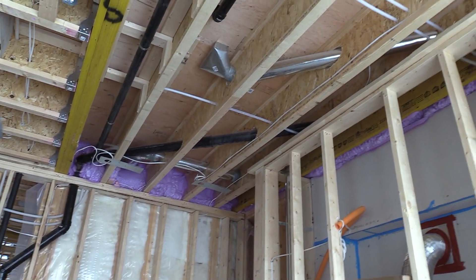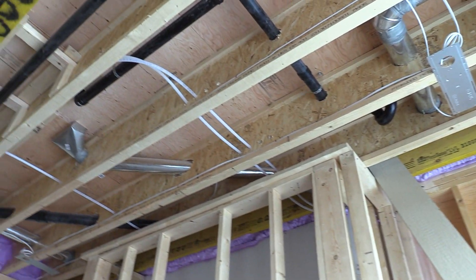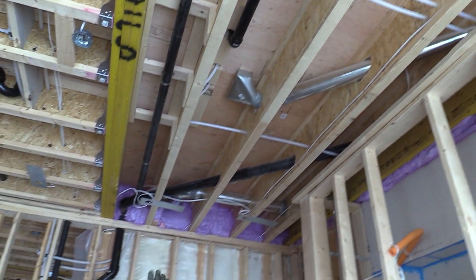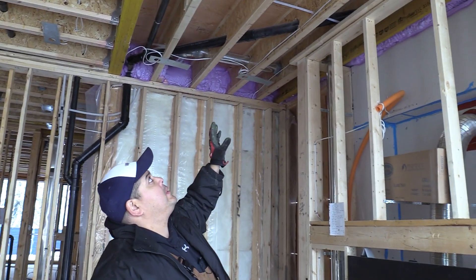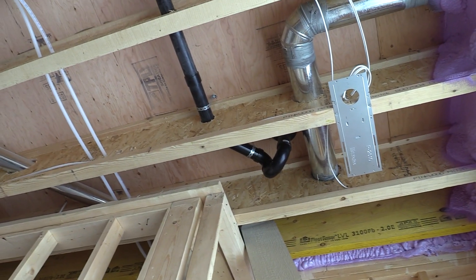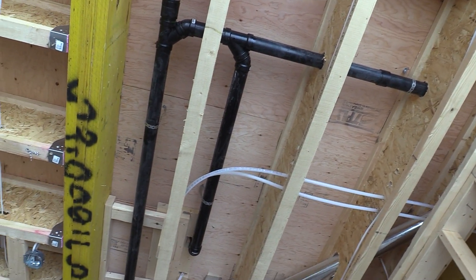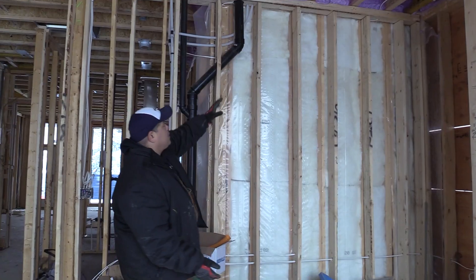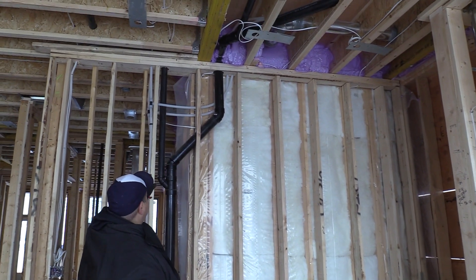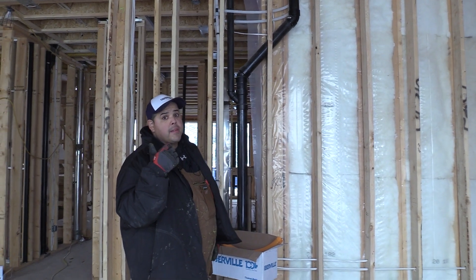This runs up into the toilet. The toilet is vented through the bathtub. This isn't the neatest plumbing — not ideally what we would do — but everything got changed on us, so we had to adapt. We added a vent to the bathtub and this serves as the wet vent for the toilet. From there we ran our three-inch down and added a three-by-two Y to pick up the two sinks and the shower in the master.